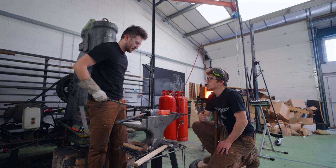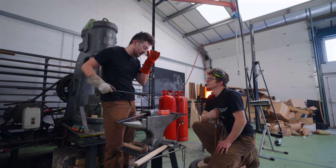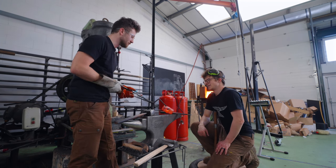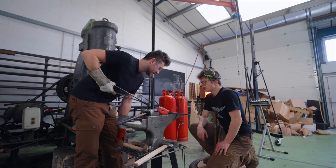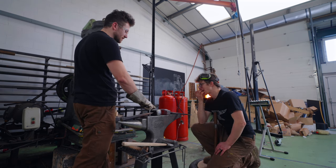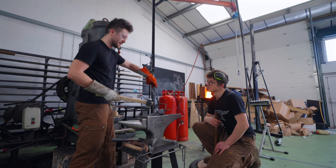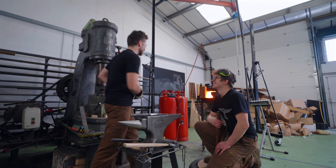This still has every possibility of turning into a beautiful hammer. I've made the realization myself that this isn't really doing anything, and I think that's because I'm not hitting the side to help that swell around it — that's my thought, I don't know if that's correct or not. Another thought is you're not hitting the drift hard enough. I need to be hitting it harder and longer as well, I'm assuming. I think I'm going to try hitting it harder and longer, and then put this thing in and line that up like this. We're going to try that.